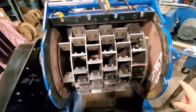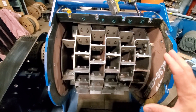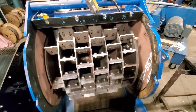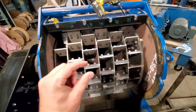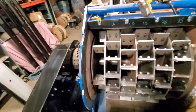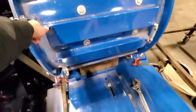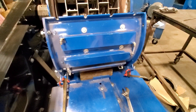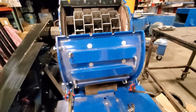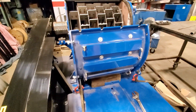As material goes through, centrifugal force keeps it to the outside. If you're running material that doesn't need to be broken down small, you can slow the turbo mill down and let it pass through quickly. If you're running material like cat five cable that has little pieces with plastic still stuck on them, you speed it up, roll it smaller, and the material comes out the other side. This unit has a jacket ready for water cooling, though this customer did not get the water chiller. If you're in a state that gets really hot or in an environment with no ventilation, I highly suggest it.